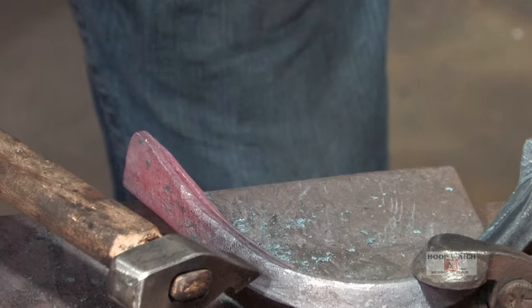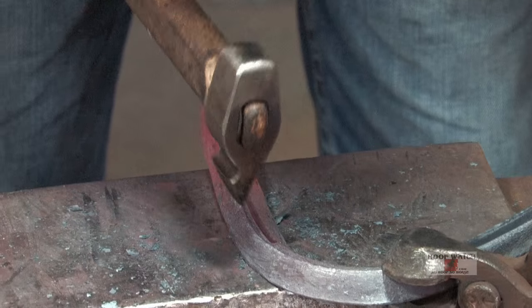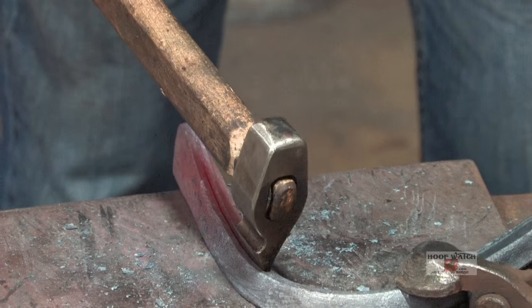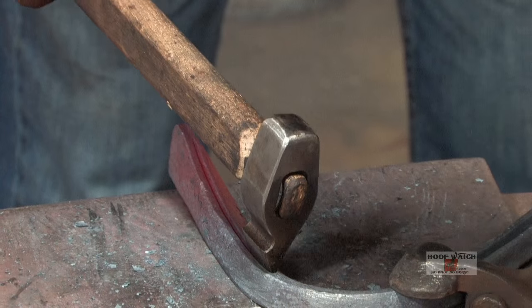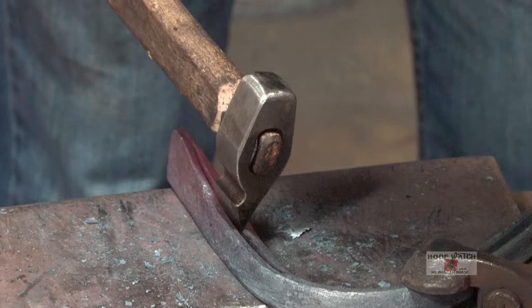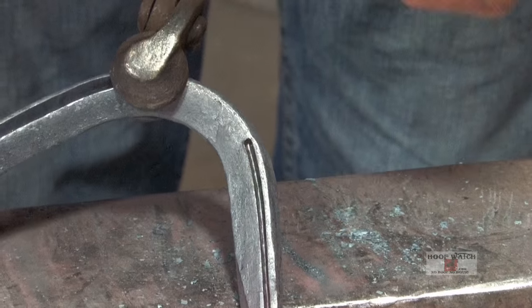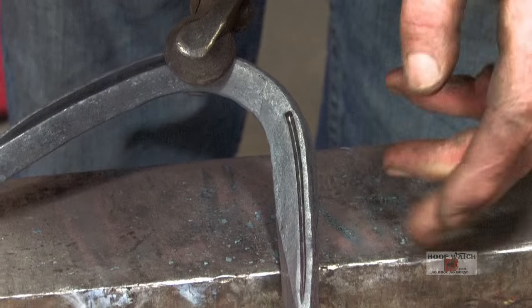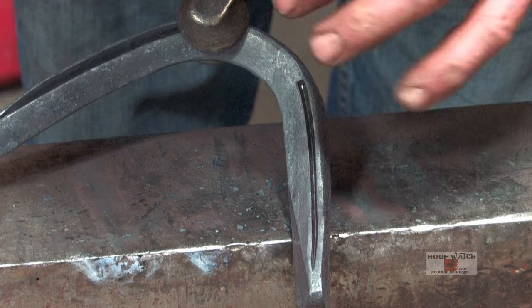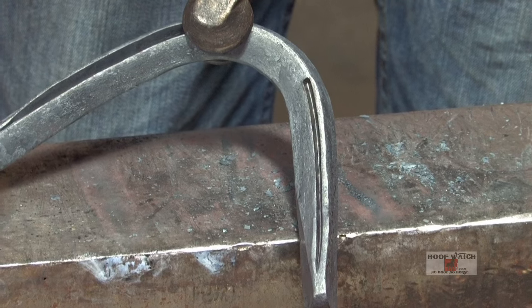The very top of the section is really flimsy, so it can go either way. So if you drive it in the way a fuller's built, it'll dive. When you're going through the very small part of the block, I want to lean my fuller over and get to the strong part of the material. That way, it won't dive in. I'm looking at this line and this line, and I'd already be too coarse, so I just want to keep it out until I get fairly down to where it's got more material to hold it together.